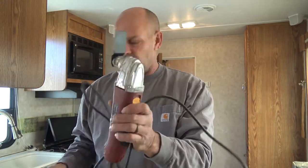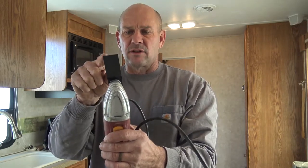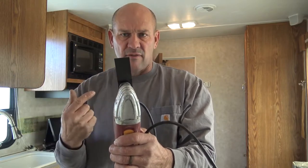Since there's not enough room for you and me in the bathroom, I'm going to go ahead and remove the pieces. It is doable with a painter's tool and then an oscillating tool with a flat blade. With the flat blade I'll just go ahead and cut at a certain point and then take off the swelled up paneling. I'll show you what I did and then I'll get back at you.